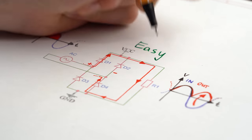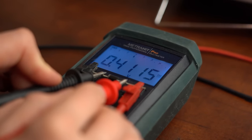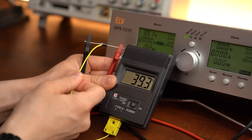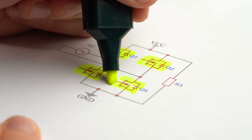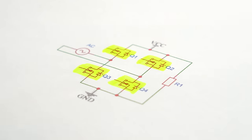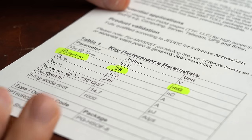Pretty straightforward, but the bad news is that every diode comes with a certain voltage drop which causes the power loss I talked about at the beginning. The active rectifier idea wants to change that by replacing the diodes with MOSFET switches that come with super low resistances and thus should decrease the power losses.